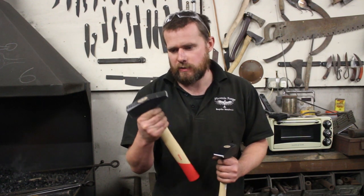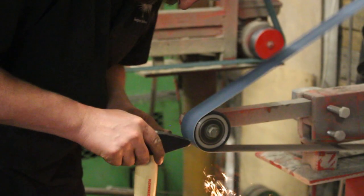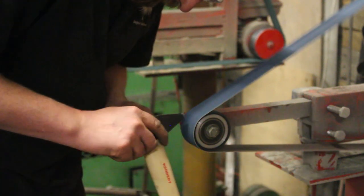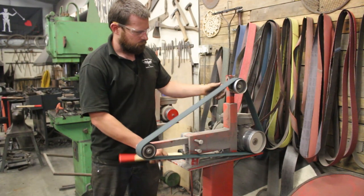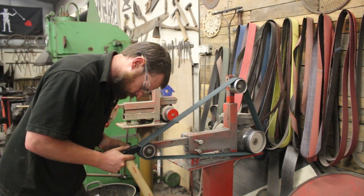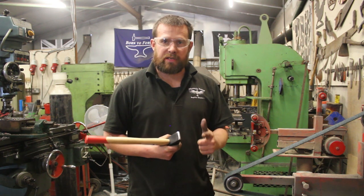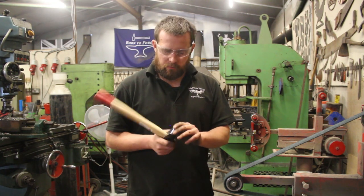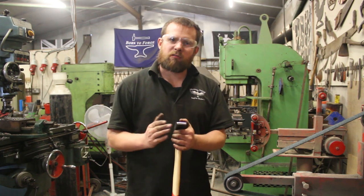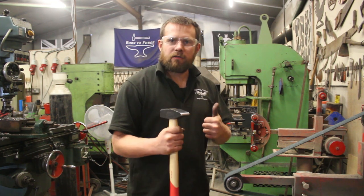What I forgot to do was the back end, so I've got to do exactly the same to the cross-peen. I'm going to take this back to the linisher and while I'm doing that I'm going to chuck some steel in the fire to warm up so I can show you how it actually affects a piece of steel. The cross-peen is finished — that took about two minutes using three belts. Went in with the 120 to start, just blended those chamfers in and put a bit of a radius there, but you don't want to bite in too far otherwise you're losing the width of your cross-peen.